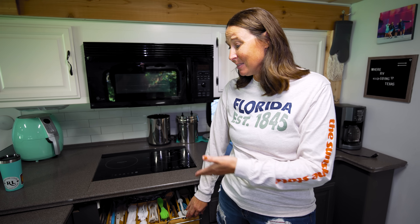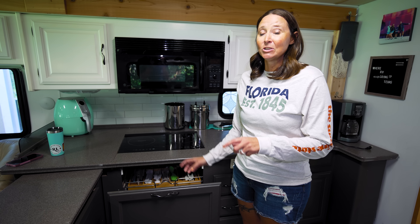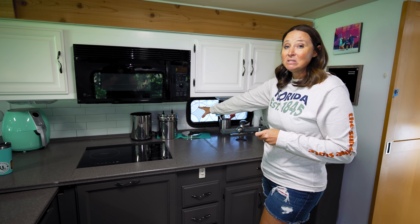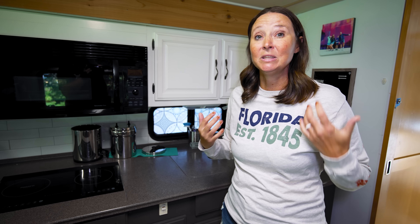This cabinet is one of my favorites because we gained so much storage here. It's a Rev-A-Shelf unit from Home Depot that fit the space beautifully. One issue we ran into: when going around corners, this heavier cabinet would slide open. We solved that by installing child safety locks from Amazon — you can turn them on and off, so they're engaged on travel days and disengaged when parked, keeping it closed on corners without hassle.